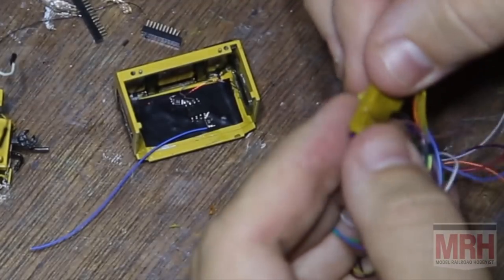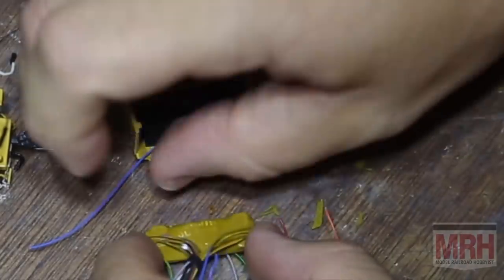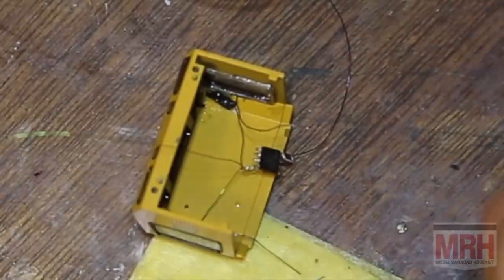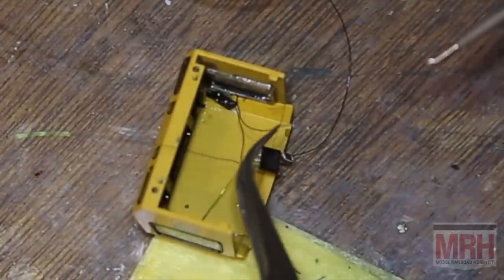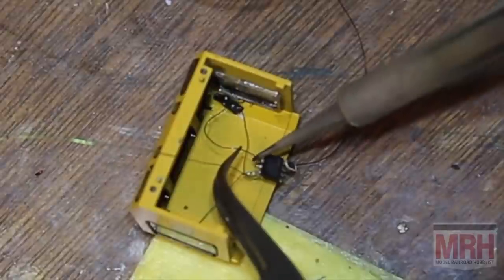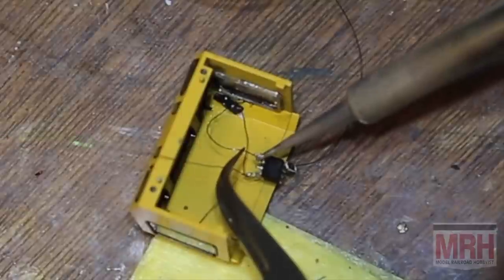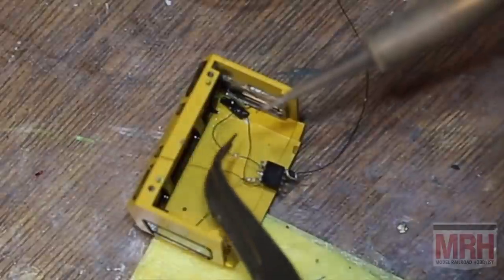The next step was to secure the decoder to the ceiling with double-sided tape. I was careful to route the wires from the strobes around the decoder. These two strobe wires, of course, were going to be attached to the ATtiny13 chip. Whereas the decoder uses a positive function common, the ATtiny13 chip uses a common ground, meaning that I had to wire the cathode wires in parallel and to a 1 kiloohm resistor, which I in turn soldered to the ground pin of the chip. I soldered the function wires from the decoder directly to that pin.